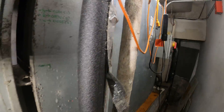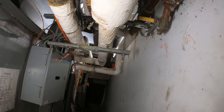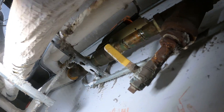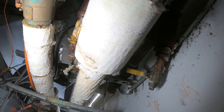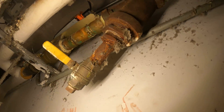It's just a large air handler. I did troubleshoot this before and there was no response by these actuators. We have one up there and one up there and we need to replace both, but in this video we're going to be replacing one of them. The space is super tight and that's what's making this difficult.